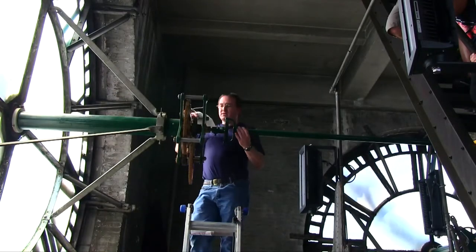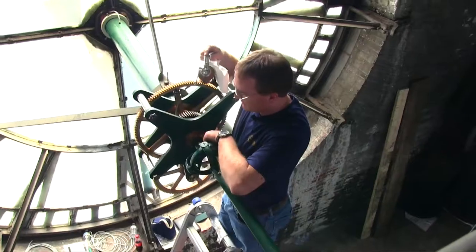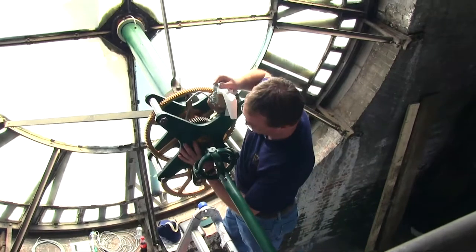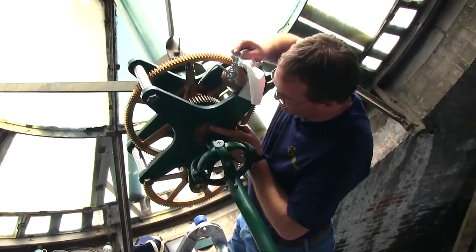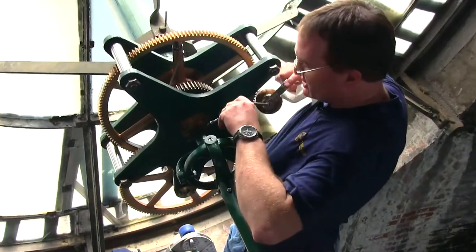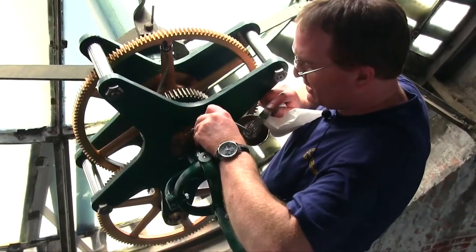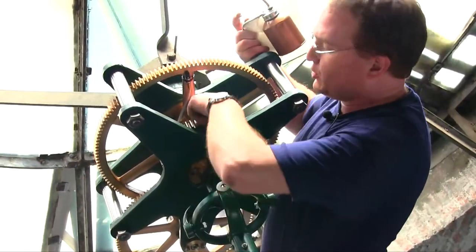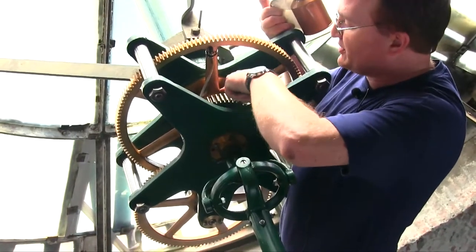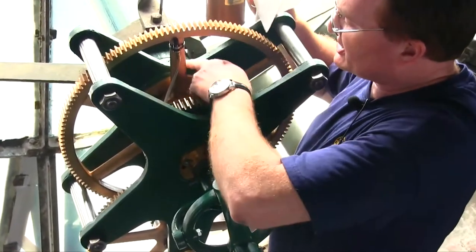To oil: start from the beginning. We've got a little flange bushing made of bronze, and on the top of it there's a little journal hole. Stick the oiler in there, pump a little oil in it, fill up the hole — that takes care of that one. Further forward, there's another one in here between the gear and the big bushing mounted to this housing. There's a little arrow there — stick the oil in that and pump a little oil into it.